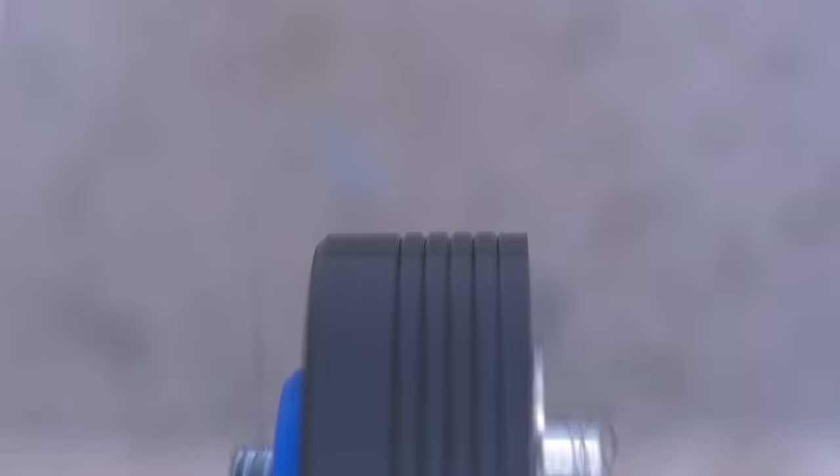Now the wheel pulley is done. Next comes a new motor mount and then the motor pulley. The old motor mount was screwed to the frame, and to tension the belt I had to move the whole motor back and bolt it down with carriage bolts in wooden slots — reaching all the nuts was a nightmare. So that has to change. Since this is a flange-mounted motor it has no foot, so I'm going to make a foot. Fortunately this material thickness still fits between the motor and the frame, which means I can use it as a base.